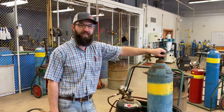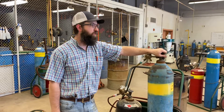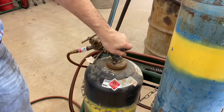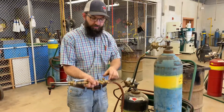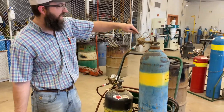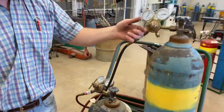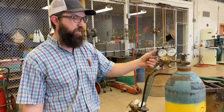The first thing we want to do before anything is make sure it was turned off correctly. I'm going to check my tank valves and my acetylene tank valve, making sure they're off. I'm also going to check all three of my torch valves. Another thing to check is that all my gauges are at zero. The last thing is to check that these pressure adjusting screws are loose — if they're loose I can turn them with one finger.